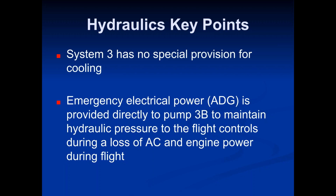In addition to those primary sources of power, you also have an APU, which stands for Auxiliary Power Unit. Okay, so the APU is for auxiliary power. Okay, so the problem with the engine driven generators is that when the engines aren't on, they're not providing power. It's the same deal like a car, right? If your car engine is not on, the alternator is not giving you power. That's why we can't just jump in our cars and just turn the key to the on position without starting it and just leave it sitting there. Why? Because our batteries would go dead, right?